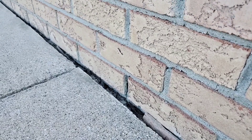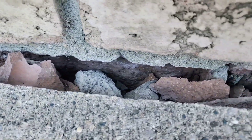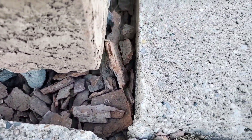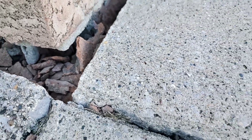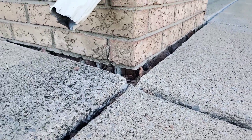On this side of the house, the walkway was a problem. We take out a slab of concrete to put in a buried underground downspout, and this is the reason why. You go to those extremes to move water away from your home.